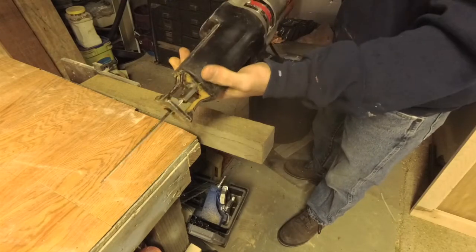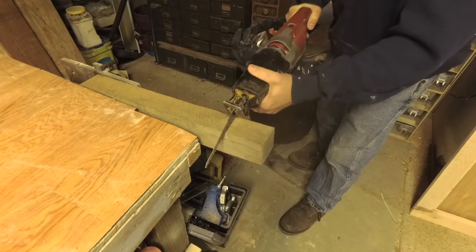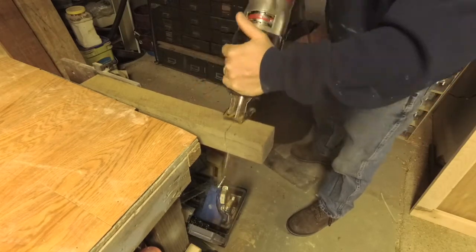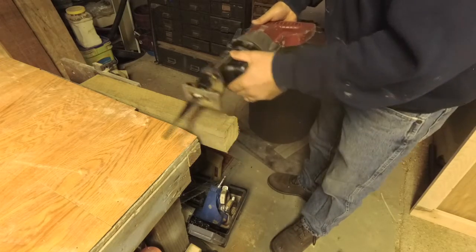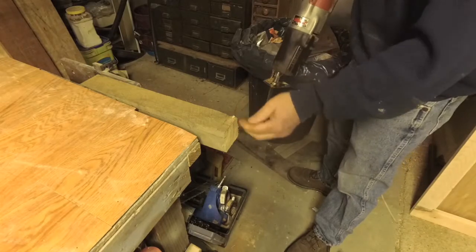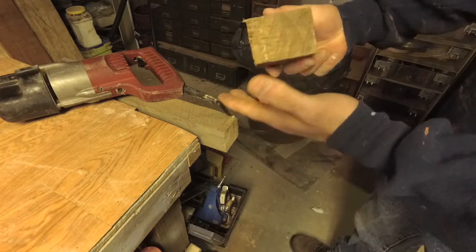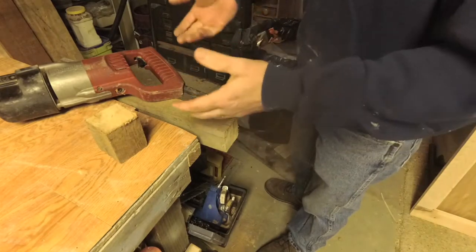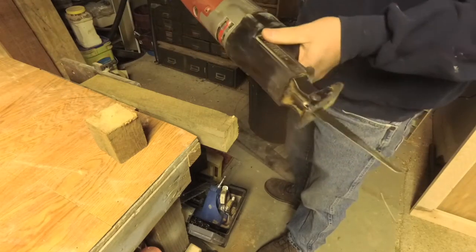Alright, so I've got it running. I'm just going to go ahead — this is a piece of hardwood, so I don't know how well it's going to do. But what you want to try and do is keep this plate up against your work as good as you can. Now this is clamped way back here, so hopefully I don't get too much shake. So there you go. Now that blade actually is a dull one so it probably ought to be changed, and this is hardwood — I think it's oak. But that did pretty good all considering. You can see it's not a nice cut, it's nothing fancy. It's just designed to really chop something apart. If you're trying to put a doorway in somewhere, it's really made for deconstruction, not really fancy stuff. But they do have a use and they are super handy. This particular one is pretty quiet too.